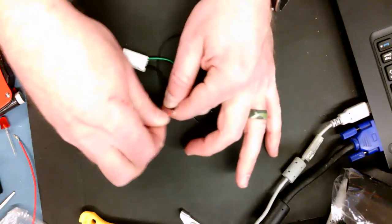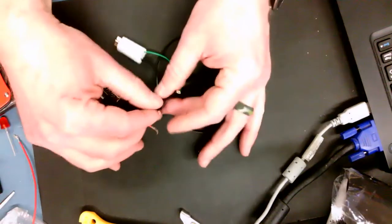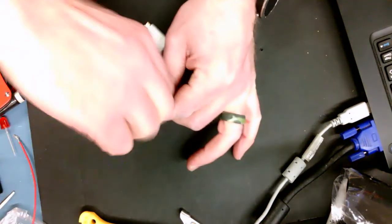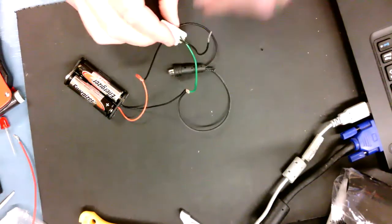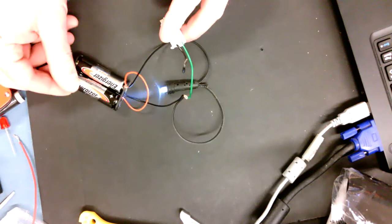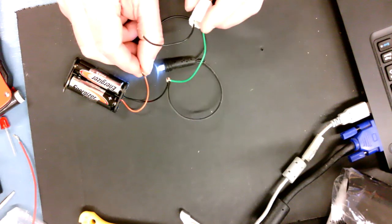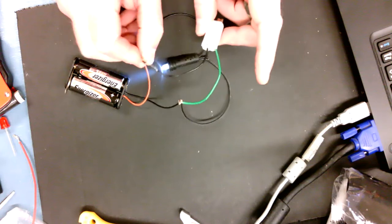And I'm going to show you, I'll just slowly remove one of the leads. Oh, that's not the one I wanted to remove. I'm going to take the motor off of one of the leads so that the motor is disconnected momentarily from my circuit. So I've removed the motor, so there's no loop for the motor. And so when I turn the lamp on, you see a really bright lamp. Now, if I temporarily touch the motor back to that spot that I disconnected, you'll watch that and I'll be quiet and you can hear it.